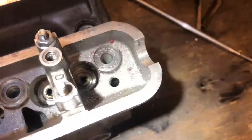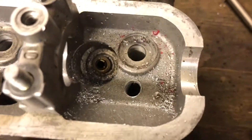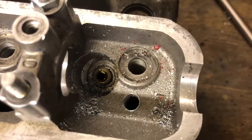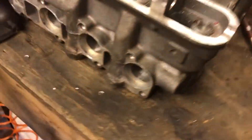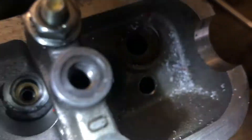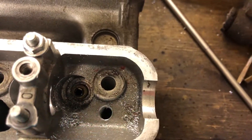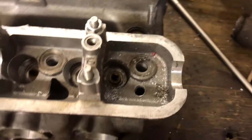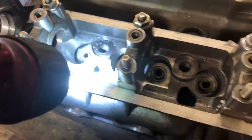We have great success — there is an 8mm hole drilled here. I'm going to deburr that edge a little bit. What I wasn't expecting — and I didn't spot until after going through with the 3mm — is I've actually moved the hole slightly further this way from where I had it. There's a bolt here and the casting obviously needs to be there to support it. You can see there's actually a fair bit of room up this end of the casting, so you could easily make that bigger if needed. I've done one hole there and another one there — there's plenty of space around both and plenty of support.